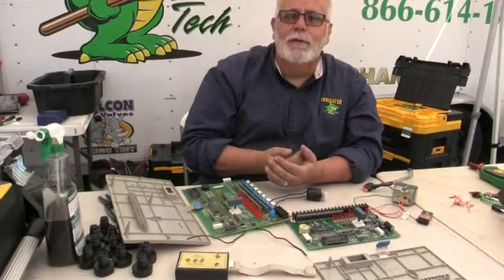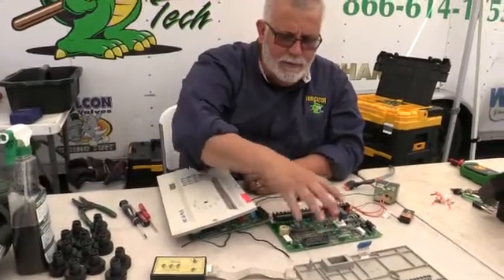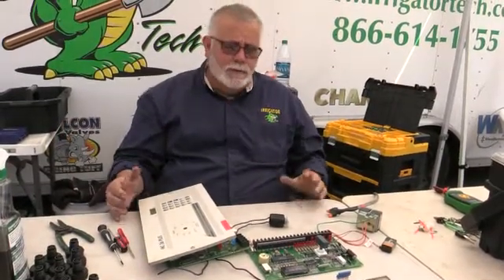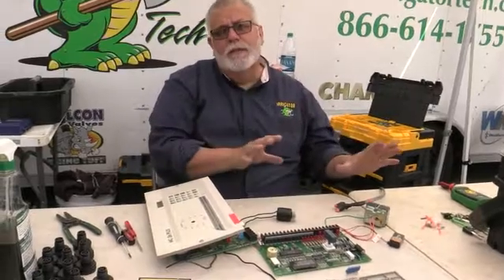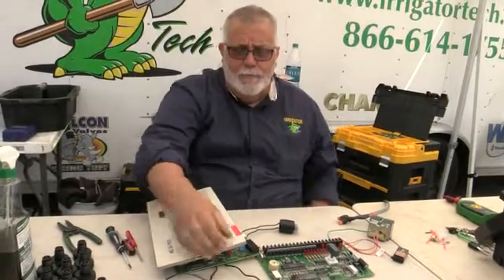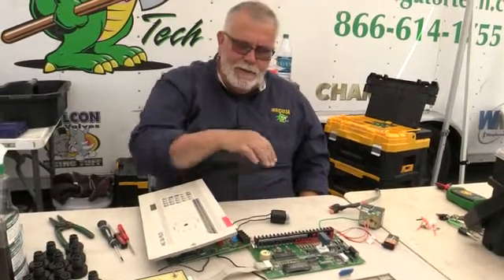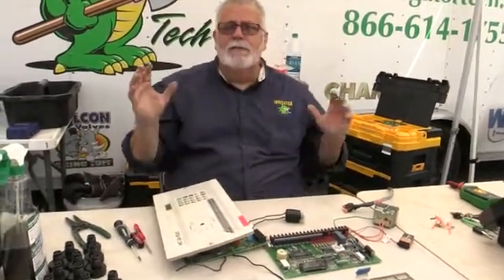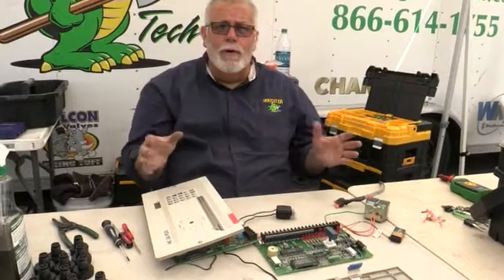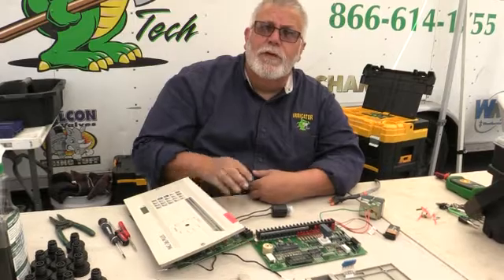You're waiting and waiting — you've got 32 stations, you're hand watering, or you have to have a spare. By de-glitching and cleaning up everything I've saved myself tons of time. You can do this by keeping a spare in your panel box, or just hooking it right up, strobing everything, making sure everything comes on, clean everything, take it back out. Make sure there's no insects. Use your contact cleaner or rubbing alcohol — no WD-40, no oil. Just clean it, wipe it all off really good. You should do this as preventive maintenance every year.